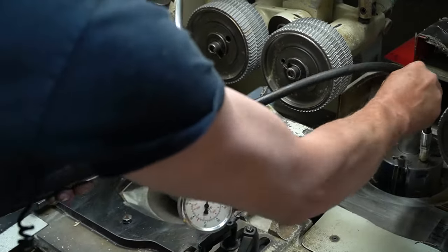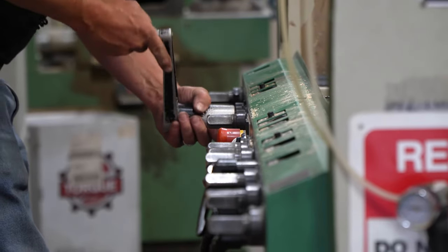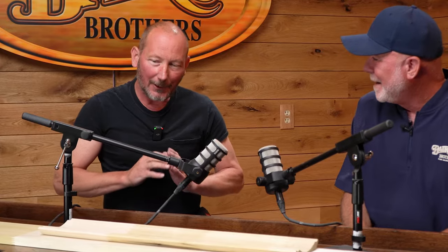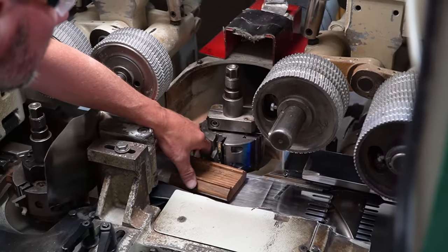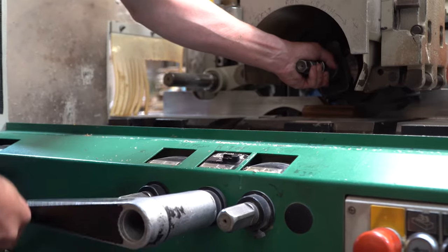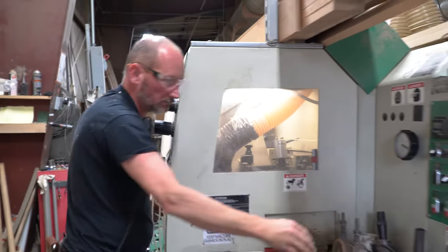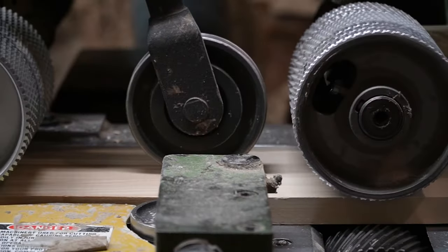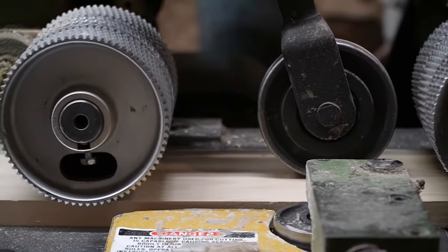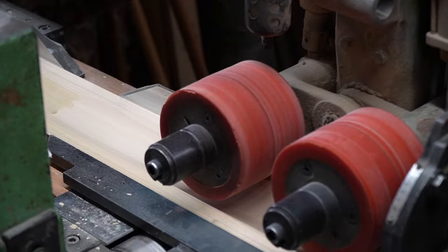Slide the head on the arbor, pump it up, dial it in, and you should be pretty much ready to go. I do a lot of SPLs on that machine, so it's easier for me to just throw the heads on and use a straight edge or a sample to run the piece through. You set a physical sample piece and you dial the heads down to that sample piece. We like to keep it around 18 knife marks per inch — 16 is what they tell you, but we like to keep it a little better than 16. More knife marks per inch means the better the finish is going to look.